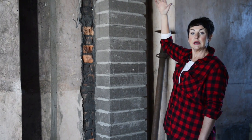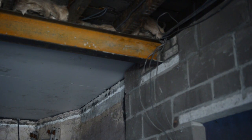Directly above that are two courses of bricks, but that will be above the ceiling level. On this side of the lounge we are housing our RSJ on a four-inch concrete block wall. If you look on top of the block wall here, you'll see the padstone, and that padstone is where the RSJ sits and again distributes the weight.